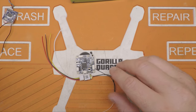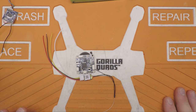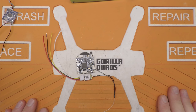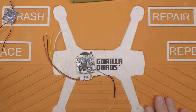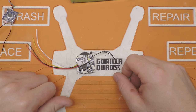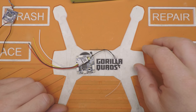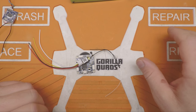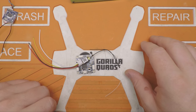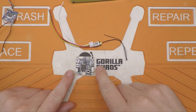This method applies to the XSR, RXSR, R9 Mini, and R9 Slim. I'm going to show you my method to figure this out — the numbers and resources may be different from board to board, but this will give you a good idea. The FrSky receivers output SBus and SmartPort telemetry, both of which are inverted signals. Unless you've got a receiver that can be hacked, there's not much we can do about it. This becomes a problem with F4 boards because we need a hardware inverter to interpret those signals.